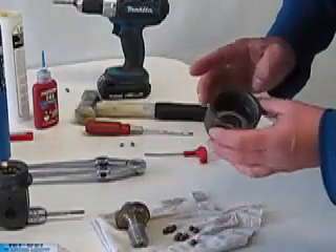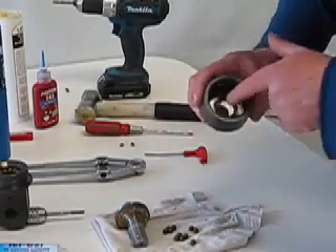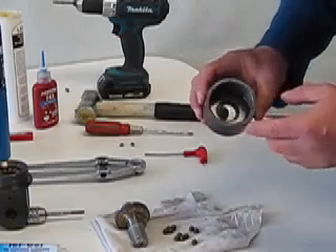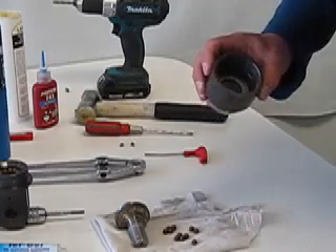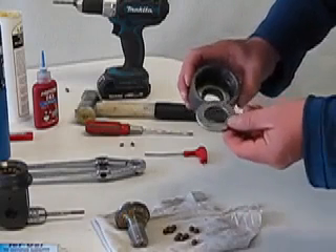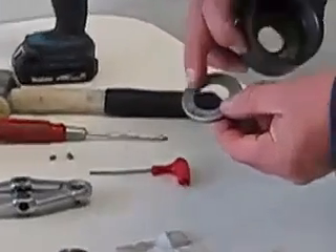The spindle is removed from the body and there will be some grease around that edge. What we're looking for is any sign of water having penetrated the seal — it'll be visible in the grease discoloring, or any corrosion on the inside of the body. In this case you can see the thrust washer doesn't have any pitting — it looks like it's in good condition. An example of one that had been immersed in salt water for some time shows the pitting.